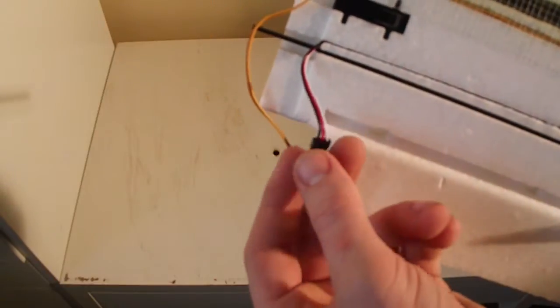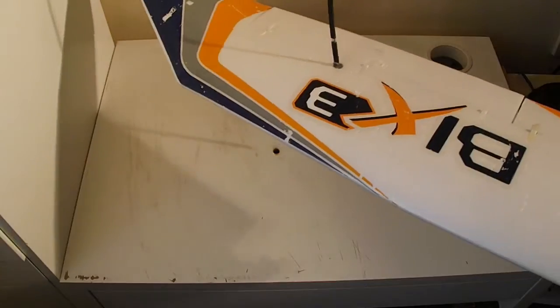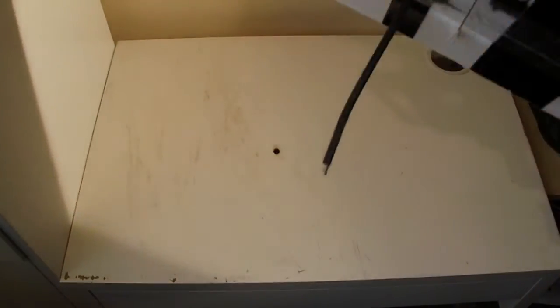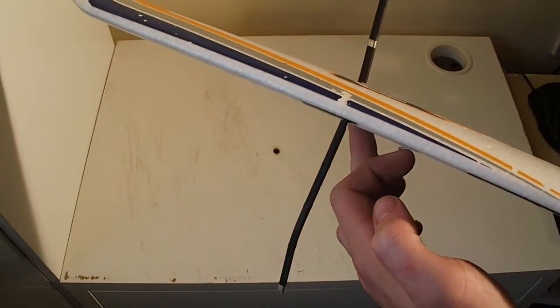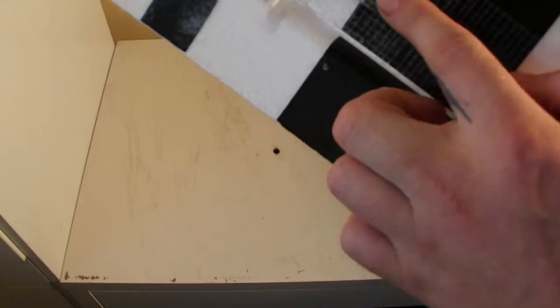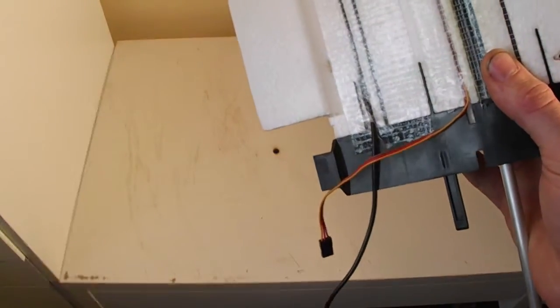With all my stuff I put the same plug on everything. I standardise the plug. So the next wing, we have the right-hand wing. It's just got the Dragon Link receiver mounted on the outside, exactly the same. Drill the holes through the centre of the wing. I have the antennas just pass straight through the wing at 180 degrees to each other, so it's a nice big straight antenna. Again, I routed the wire inside the wing, all the way down and out to the end, and now I just plug that in every time I assemble my plane.